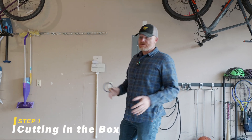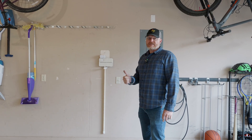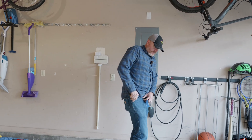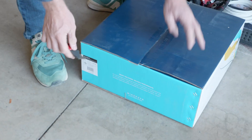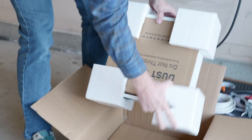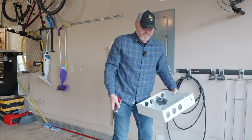The first thing we're going to do is set our location for our box. Directly on the opposite side is where all of our demarcations land from the other internet providers — we've got cable, we've got DSL, and now we've got fiber, or about to have fiber. What we typically do whenever we're pre-wiring a home before it's been built is we always put one of these fiber panels in, that way anybody that comes in the future as far as internet can bring and land directly to the site and have easy access into where we maintain all of our network equipment inside the home.